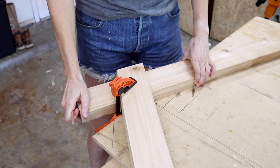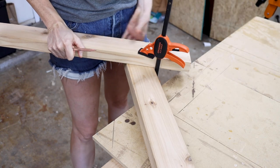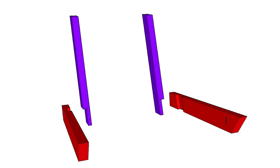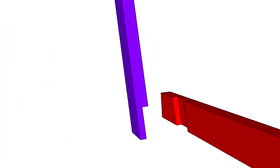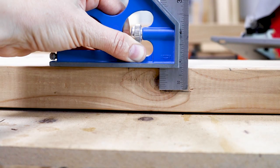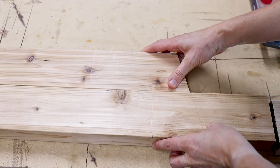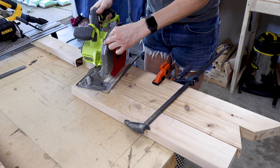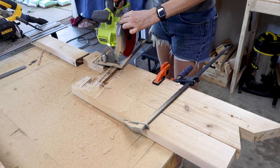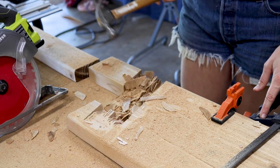I clamped the two joining boards together and marked the angle that I wanted. To make this joint a little bit stronger and get the look I'm going for, I'm using a half lap joint — this means I'm going to remove half of the material from both of the members so they overlap and join. I set my circular saw to the correct depth and then I clamped the two members together so I could cut them to the same width at the same time, making many passes to cut away the bulk of the material. I used a scrap piece of wood in front of where I was cutting so I had a flat surface for the bed of my circular saw to rest on, which also helps prevent tear out.